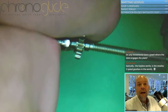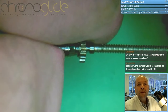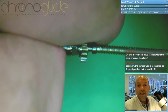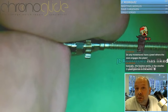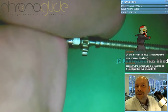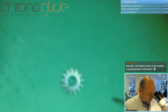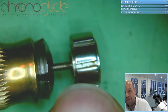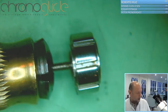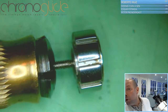Do you see? I'm having a bit of friction to both pinions, but the sliding pinion is always moving because it's square, and the winding pinion doesn't move because it's round. A crown is secured with a bonding agent.